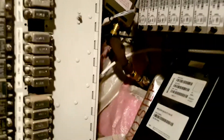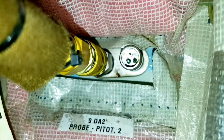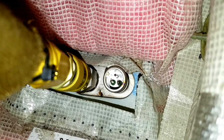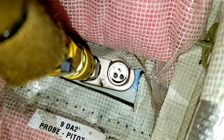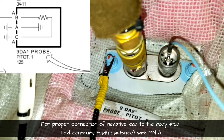We will show Pitot number 2 first. It is on the right side of the nose — this is the access point. We disconnect the electrical connector and check the condition of both the receptacle and the plug. Check the location of the key way, which helps locate all pins — it is also marked on the receptacle and on the plug. As per the procedure, I connect the negative lead of the insulation tester to the body of the Pitot on the mounting stud. Since there was a little paint on it, I scratched it off. For checking proper connection, I do a resistance check between the body stud and pin Alpha, because pin Alpha is the ground.